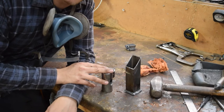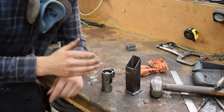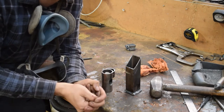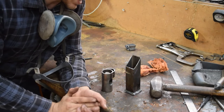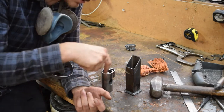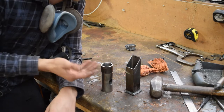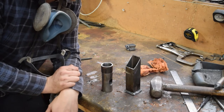What we're doing now is making the copper head of the hammer. We've got that thread in there and put a nut on that's going to sit about a centimetre up proud. When we pour the copper in there, we want it to float underneath and around that nut so when it hardens it becomes homogenous — the nut is locked in there, mechanically bound as a captive nut. Copper doesn't bind to mild steel at all, and I've gone for a nut rather than a hook because I want to be able to unthread it eventually, melt it down and recast it. We've also got this little skirt so we can pour the copper proud. Let's get the furnace going.